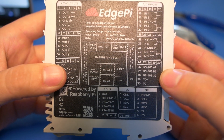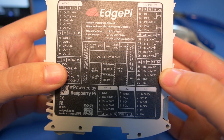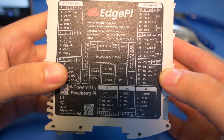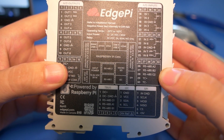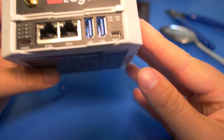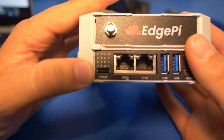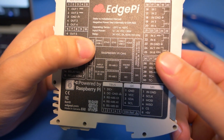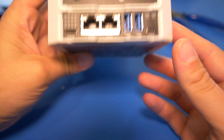They have a block diagram in the center with the Raspberry Pi CM4 in the middle — all the standard stuff that ships with it. Something interesting is they have two Ethernet ports, so I'm assuming we're going to open this up and see an Ethernet switch inside. There are two USB 3 ports, HDMI, eMMC, and a USB-C. That USB-C is in the same block as eMMC, so I'm not 100% sure about that.